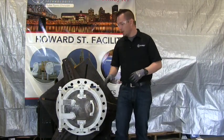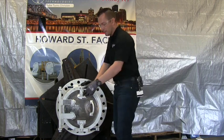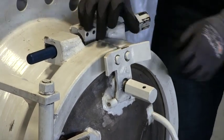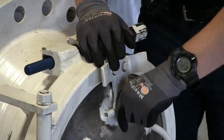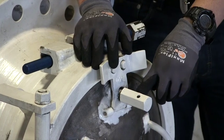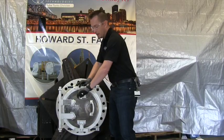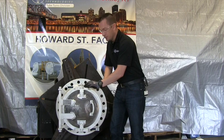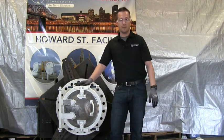After adjusting your timing, you're ready to finish closing up the closure. Tighten your PWD all the way down — the flapper should still be loose so you know the gasket inside the PWD is properly seated at the top of the nipple and won't release any pressure. Once the PWD is torqued down and the yoke bolts are torqued, and the flapper is still loose and moving, the closure is ready for service and safe for use.